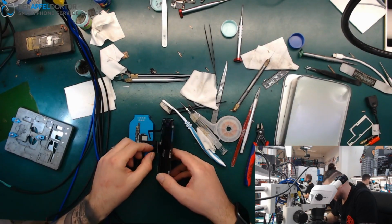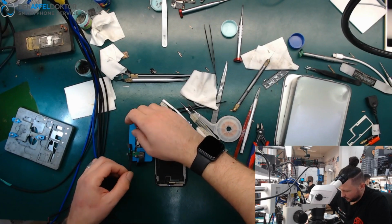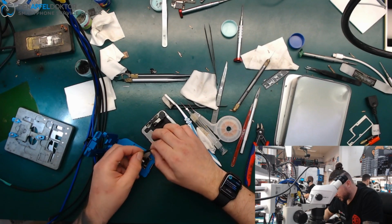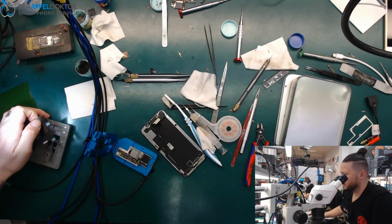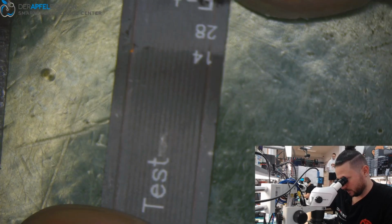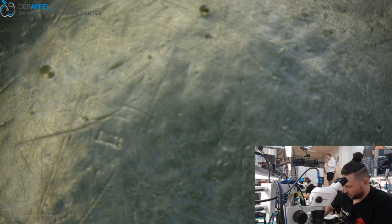take a look for the touch, because on my flex cable here, normally the touch doesn't work. That's right, but it's not related to the board. It's related to, you see that? I can show it to you under the microscope. You see, that's my touch connector here, and you see that? Here. It's broken. So sometimes it works, sometimes not. But now I just want to reball the bottom board.